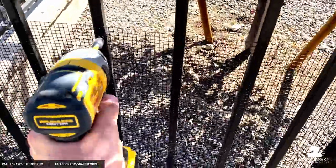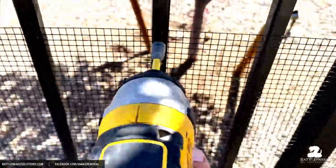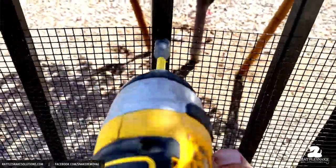There's a lot done to avoid using screws, but screws themselves don't actually damage the fence at all. You might think a screw puts a hole in there — isn't that worse? Not if you use the right type of screw. We use self-tapping screws with a little gasket on there, so when the screw is put in, it's sealed tight and easily removed.